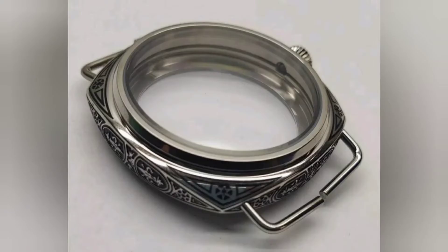I also have to clarify that I will still have to resize the dial. I decided to buy the smallest possible case, which is 45mm. This case can accommodate a dial of 36mm and has a visible area of 35mm. Obviously, first I bought the dial and checked its dimensions. Its printed area is 34.8mm, which is just perfect.